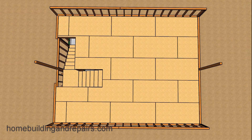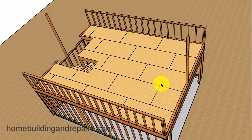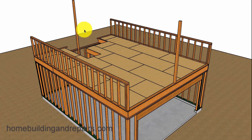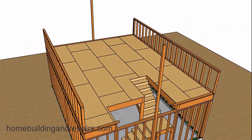We're going to be able to set the walls on top of the floor in this example — not like the first video — because we're going to use a ridge beam to create a vaulted ceiling, which will provide us with plenty of headroom. If we didn't use the ridge beam, we would need to install rafter ties that would go all the way across, providing us with an unusable area up here. In this example I have 4-foot walls — someone pointed out that if you use 4-foot walls, they will be easy to drywall. In our first example I used 3-foot walls along with balloon framing, so here I made the walls a little taller to provide more headroom.